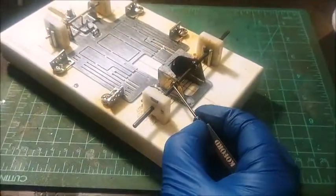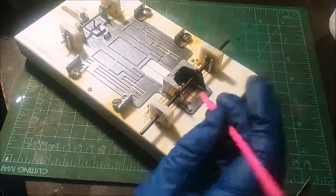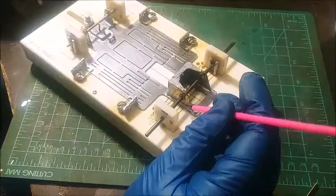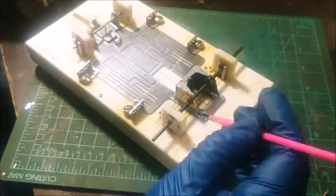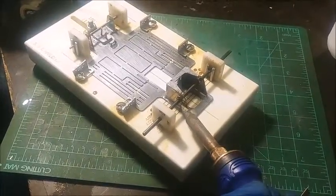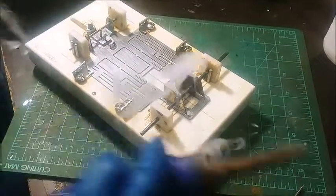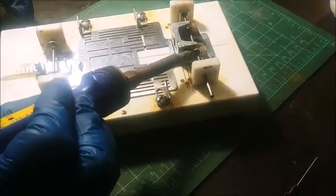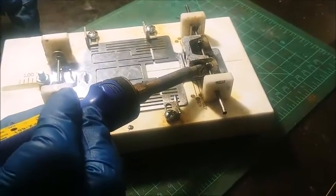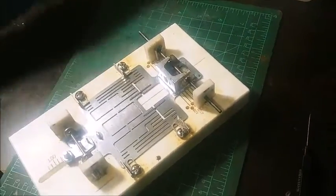I haven't lost a bushing in a long time, but over time, if you're racing a car, you want to make sure that things aren't corroded. You got to replace bushings anyway. They do get worn out. I have a tendency of running like 2 seasons before I replace my bushings, and that's not really good practice. But you want to check things, because if you got something that's corroded in your box, or things break down over time with grease and you are taking hits during racing, just check all your solder joints from time to time. So I'm just kind of getting in there, getting that solder to flow in there front and back. That sucker is locked in.